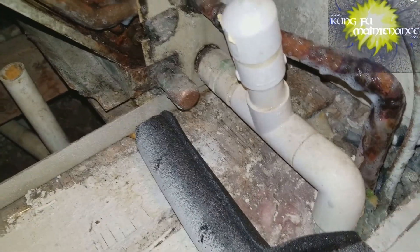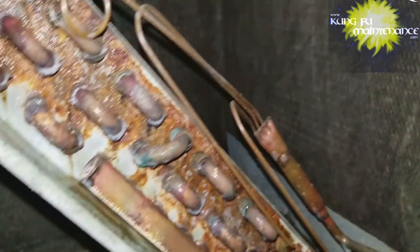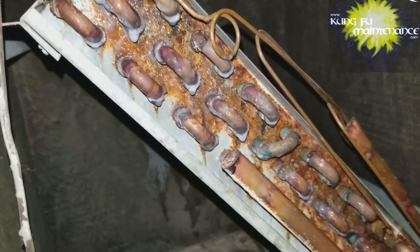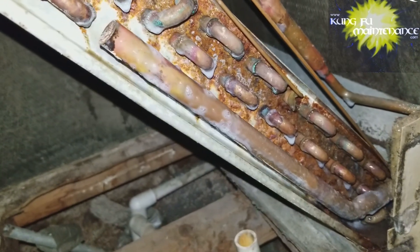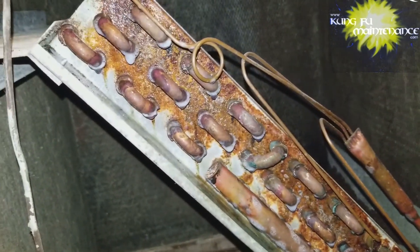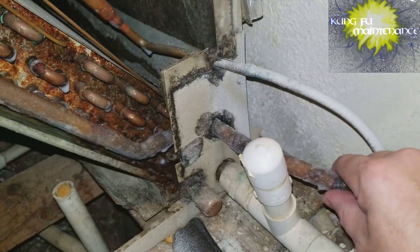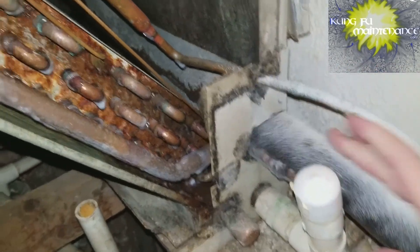Any place there's a connection — I'm checking all the tubing. Now we can only see this side; can't really see the other side, and that's where you'd need the UV dye. I don't see any leaks here. Sometimes I like to use my electronic leak detector to sniff out for leaks, and then use this to follow up and prove exactly where it's at. But I don't see a leak at all. So it's nice and cold. We'll go ahead and get our cover back on.